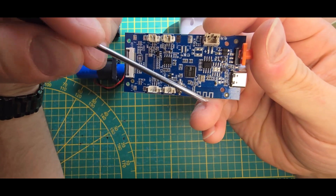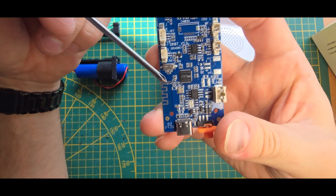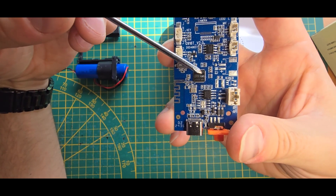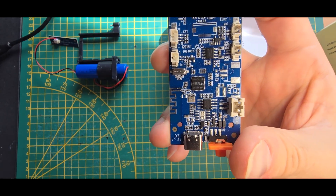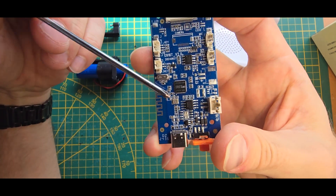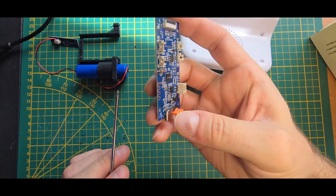You also have the Wi-Fi antenna here. Overall this XR chip is quite impressive — it's somewhat comparable to an ESP32, even the ESP32 S3. The AT version has 4 megabytes of internal PSRAM, and this ATS version has 8 megabytes of internal PSRAM — quite a lot of RAM. Combined with the external flash, there's quite a lot of storage included here.